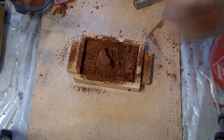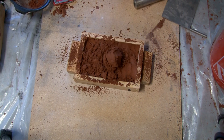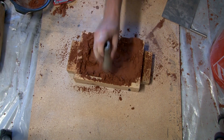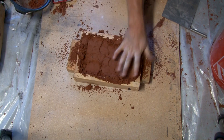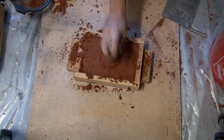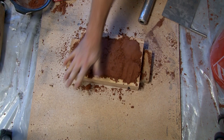You're actually watching the third take of this video. The paint I used on the 3D printed pattern never really dried hard — it was kind of a soft paint, a different paint that I tried. It was shinier; I thought I could see flaws in it easier so I could sand it, but it ended up never really drying, and it caused the parting powder and sand to stick to it. So the sand is still stuck to the part, and you'll see I'll have to do some clean-up work after I pull it out of the casting.